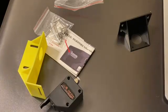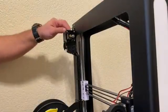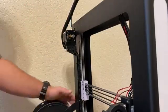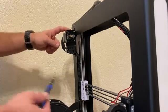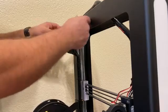I'm going to take this apart, take apart my old extruder, and get this thing fitted up to show you what that looks like. I went ahead and got started on removing some of this stuff just for the sake of time. We pulled our filament out, got our bowden tube out of the top of our extruder, and to remove the extruder we have three screws — one up here, one down here, and one in this corner.